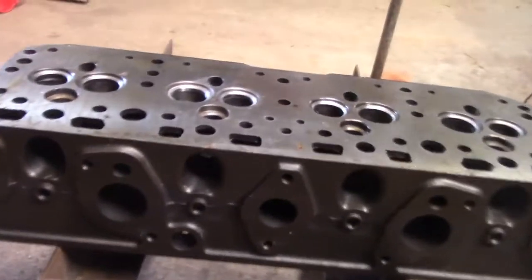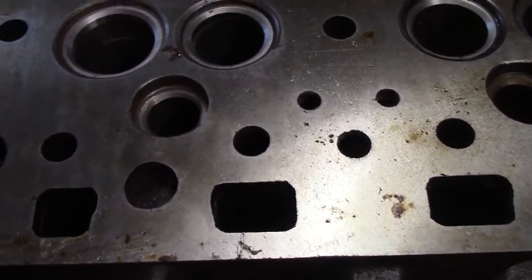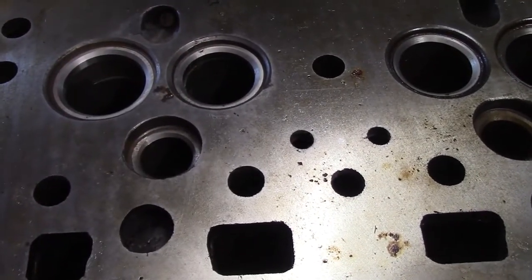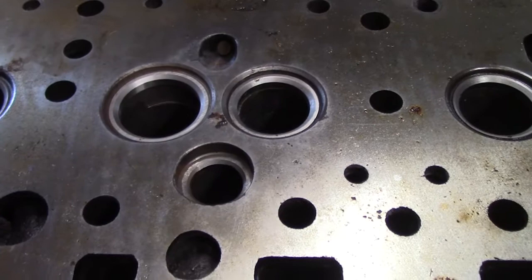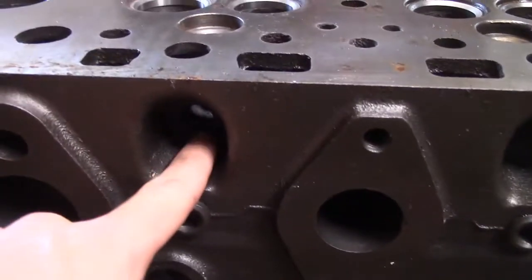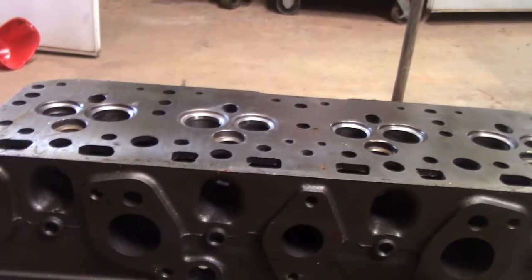For the starting valves, this chamber is actually a lot bigger down in there than you would think. When you kick it to the gas side this valve opens and creates more space inside your combustion chamber, therefore lowering your compression to allow the engine to run on gasoline versus diesel. What it also does is when that valve opens it exposes your spark plug, so your spark plug goes right in here inside of this passage — and that is how you get your gas to ignite.